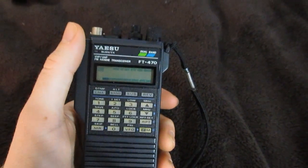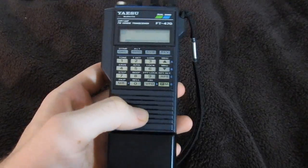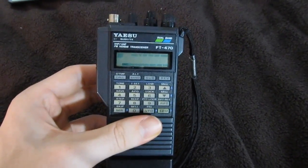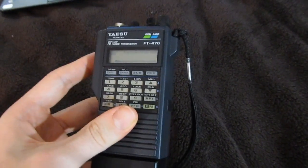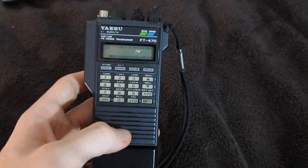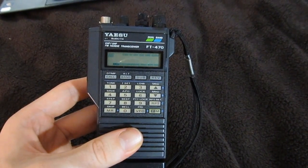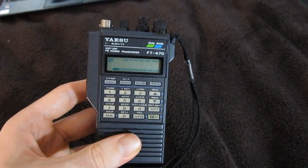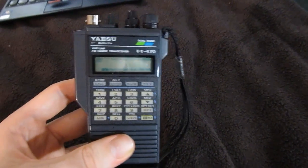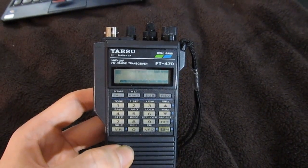Lot number 20 was apparently the first lot where Yaesu solved the intermodulation issue. Back around 1990-91, people really started realizing the intermodulation problem — you can actually look on Google Groups and find Usenet posts from the early 90s of people talking about it. People spoke up enough that Yaesu, the good company that they are, actually offered that each and every person who had an FT470 they felt had a problem could send it in. Yaesu would give it a full going-over and completely solve the intermodulation issue for free. The solution was to change the intermediate frequency, I believe.